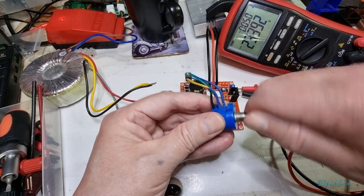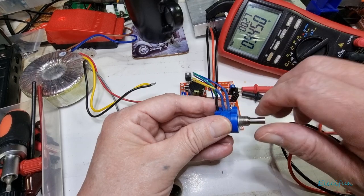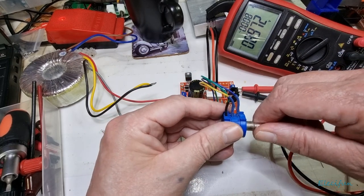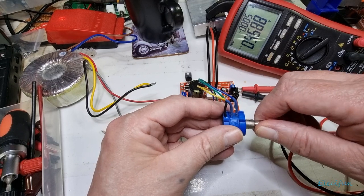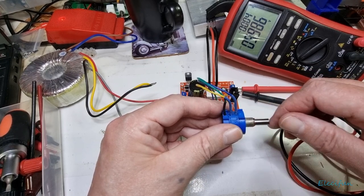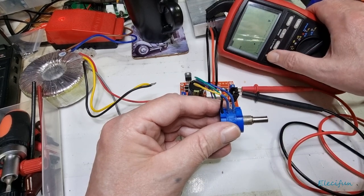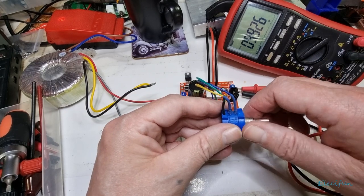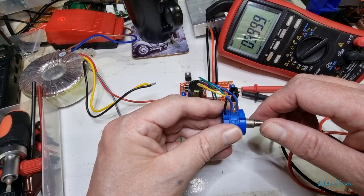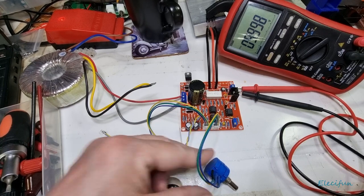Pretty much zero AC. I'm going to turn this down and get it onto 10 volts because I'm going to connect in that resistor and just see if we're getting one amp out of it, because that's what it should be — at 10 volts with a 10-ohm resistor we should have one amp. There's a little bit of delay. That'll do it — it's going to settle around about 10 volts.